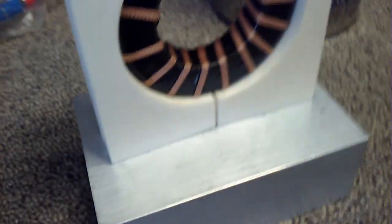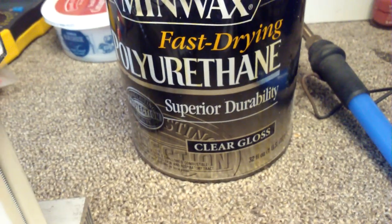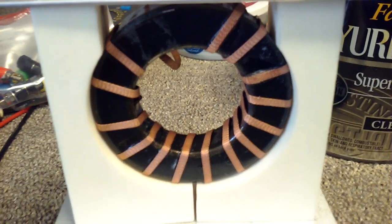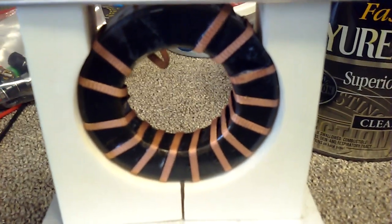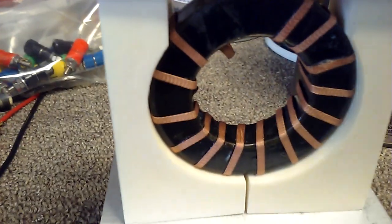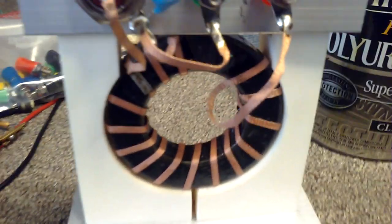The materials I'm using here — you can see I'm using a very large heat sink, and I'm using a polyurethane coating on the ferrite core so that I can easily use any kind of uninsulated wire I choose. In this case, I'm using solder wick. You could go ahead and coat that as well, but it's not necessary once the core is coated.